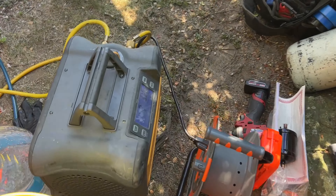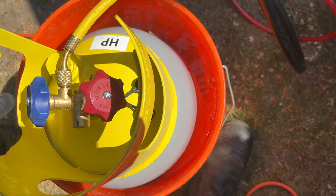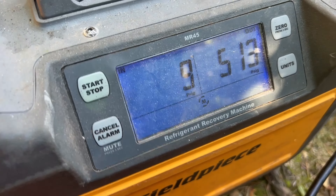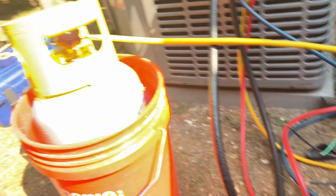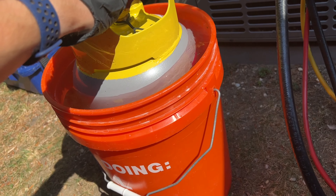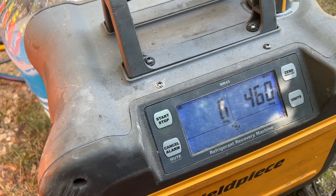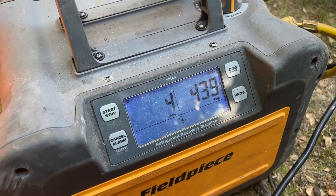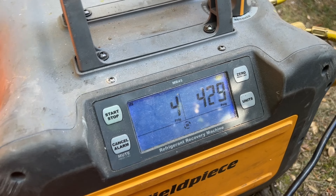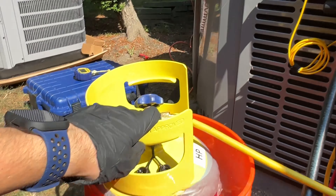It's so hot outside — almost 530 PSI — and we'll see how much this water cools it down. We're already dropping. With the lower pressure it should also fill the tank faster. We're down by 50 PSI already and still dropping. Now it's almost 100 PSI difference. After about a minute it's already down about 200 PSI — that's a lot. We'll weigh the tank and see how much refrigerant we pulled out to get an idea of how much we'll need for the run.